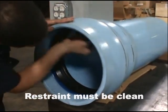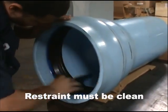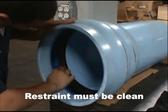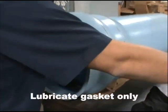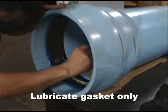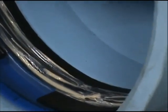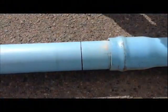Like conventional PVC pipe assembly, the bell and spigot need to be clean and free of any foreign material. With Bulldog, the grip ring must be clean and free to spin in the casing. Unlike conventional PVC pipe assembly, approved assembly lube should be applied to the gasket and not the spigot of the pipe. Take care not to get lube on the grip ring. Lube may be applied to the bevel or chamfer of the pipe if applied sparingly. We're now ready to assemble the joint.